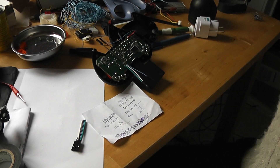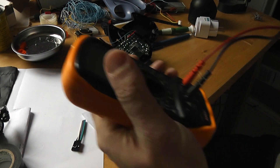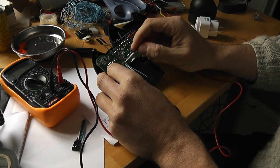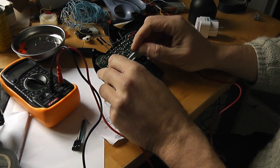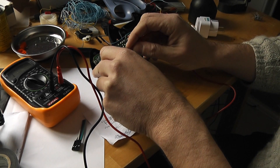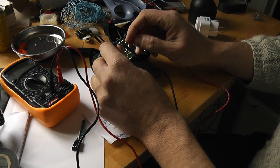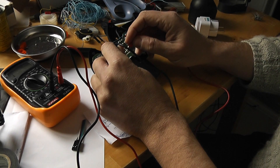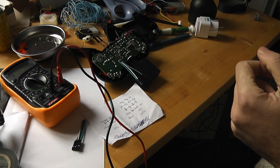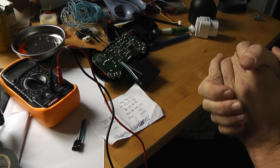It's done. I will check that there are no shortcuts between tracks. It seems to be good. Now I just need to plug in with the analyzer and we'll be able to capture the SPI data for this radio protocol. Thank you for watching.